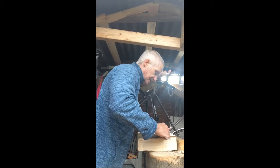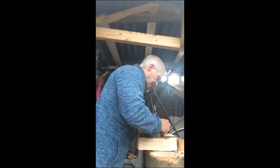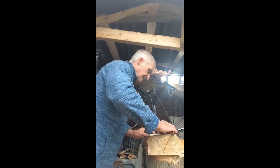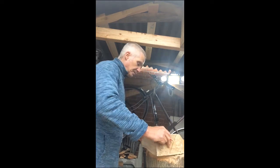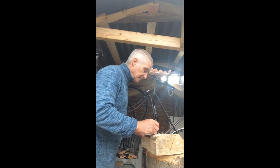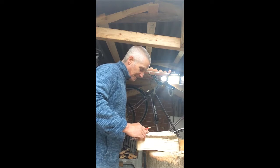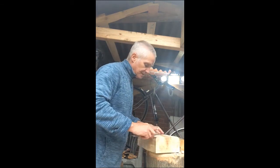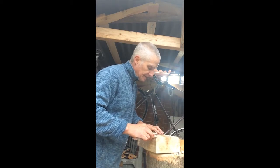And here we are, we're going to put in our center here, 14 centimeters, there we go, nice and clear like that. Now what I then do is just use the ruler to mark out the circle of the bowl itself. So I'm just putting it right there at 7. Oh, I have to remember it's not 15, but it's 14 now. It's 7. I'm just drawing a little tick mark all the way around here, like that. Little tick mark, maybe a little tick mark there in the middle.